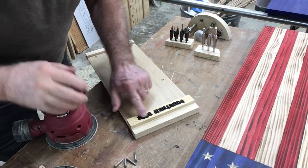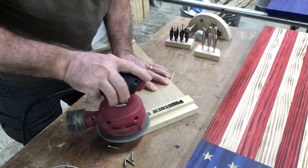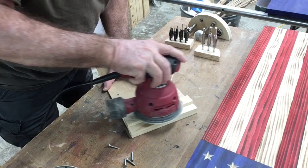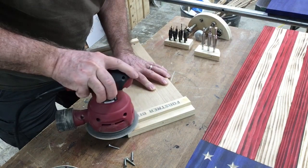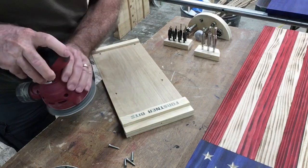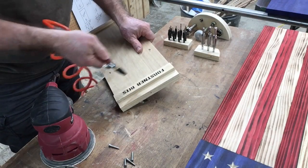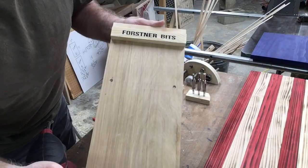Now that the paint's dry, I'm just going to sand this off with 220 grit paper. The sanding goes very quick — this is a small piece of wood, only one inch wide. The results are quite amazing, it makes it look really good, really professional. And looking at it, there's virtually no bleeding of the black paint into the wood. And there we go — all finished.